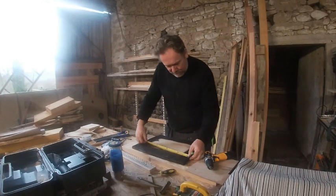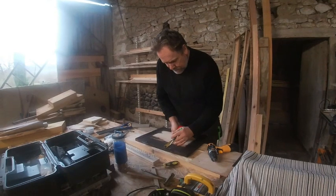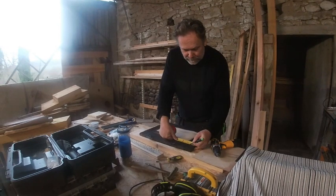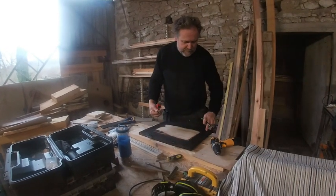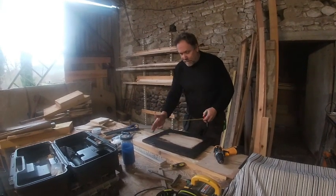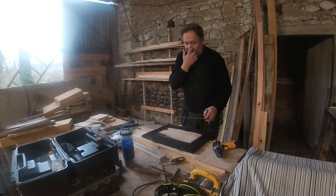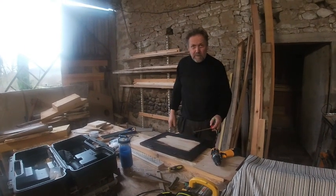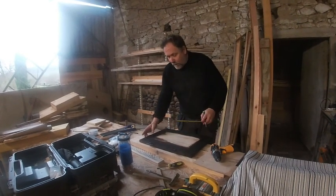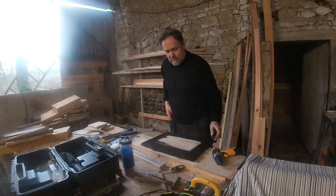And that will be all ready now for somebody to put the seat pad on. I reckon if you have your pins at about 40 mil, so the edge of your pins running down at 40 mil. Okay. What do you reckon? Yep. The only thing, obviously, you've got a slight angle on this, so you'll need to cut it at a slight angle. Because there's angles everywhere. So do you just do 40 mil in from all the sides? If you do 40 mil in from all the sides, yeah, bearing in mind, that one will be on that angle there. Like that. Right. Okay.